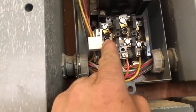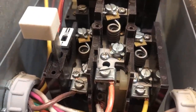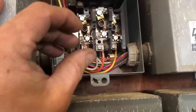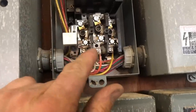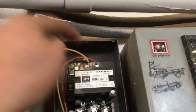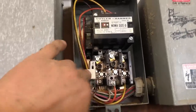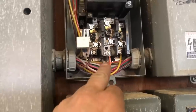Now, when you have a fault — when you draw too much amps or something goes wrong — you've got these three little heaters, one, two, three. Depending on the size of the wire in those heater coils, that's how much resistance it'll take before they heat up. They all work off of temperature, like a resistor in your car. When either one of these legs gets too hot — if one leg's drawing too much, or the motor goes bad or whatever — it'll drop that out and open up this circuit, going from the white wire to the red wire on the negative side of your coil. You lose ground to your coil and it kicks out. When it kicks out, you've got to come back and reset it, and it won't reset until everything cools off and it reconnects that circuit on the auxiliary down here.